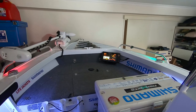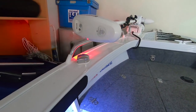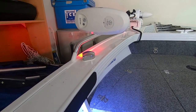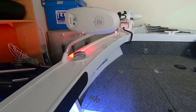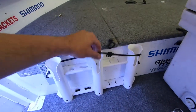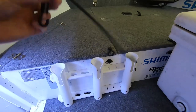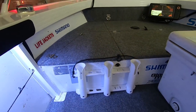I've also changed the nav lights — the original ones faulted, so I've now got stainless steel much better ones that don't rely on water ingress directly to the incandescent bulb. These are LED, a bit nicer, a bit more steel. Previously I had a rod holder here — I've now just upgraded with a little lanyard that pops out of the rod so I can actually strap that across the rods on the way to the ramp or when traveling, just to keep the police happy.